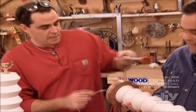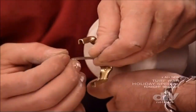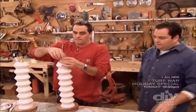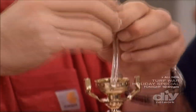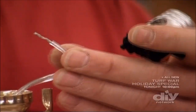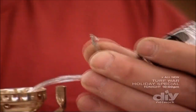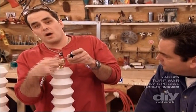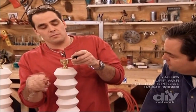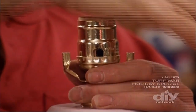I'm wiring the lamp through the base. We're going to get it through here — make sure we have enough to come up out of the top before I make the turn. And now I'm going up the center shaft. There's our lamp wire. What we want to do is tie a knot up here so that it doesn't pull all the way through. You want about a quarter inch of wire sticking out. We give the wire a hook like that, wrap it clockwise — that's the direction you tighten the screw. I've tried it the other way; it rejects it. And then that snaps in — it's a one-way fit.